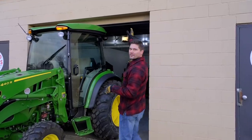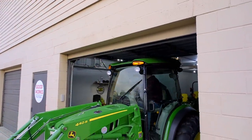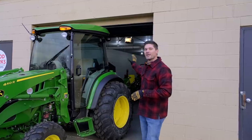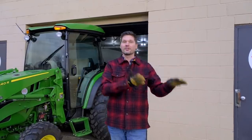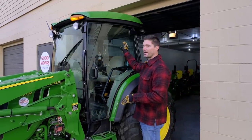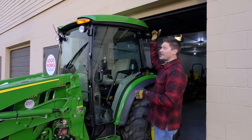It's one thing to not have enough floor space inside your storage area, but what if you can't even fit it in because it's too tall? This is proof right here — all the way up to a four series John Deere with a cab, you can fit underneath a nominal eight foot door. An open station four series and anything smaller has a foldable ROPS bar that folds down in half, so you can actually fit underneath a nominal seven foot high garage door — all your standard homeowner garage doors. If you have a cab, whether it's a two, three, or four series machine, you're not going to fit it underneath a standard seven foot door — you've got to have an eight foot door.